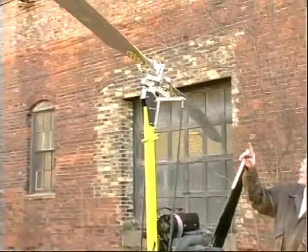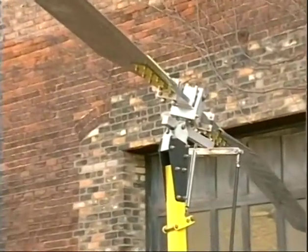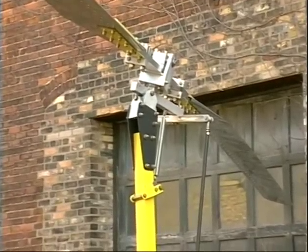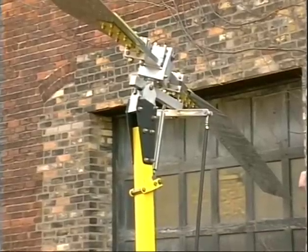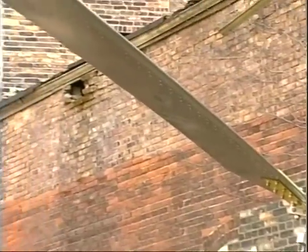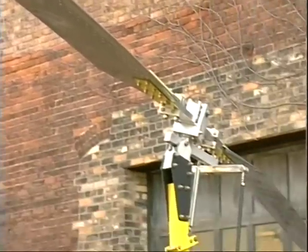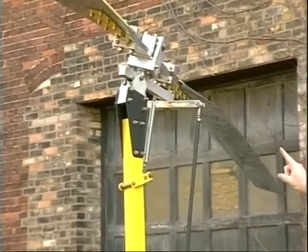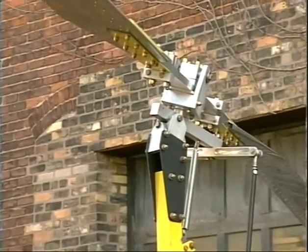Now, another element in making the gyro, more specifically the Honeybee gyro, fly the way it does, is the rotor system. This is a 24-foot Rotor Hawk control system. We use a synchronized system that Neil puts out for us at Rotor Hawk that uses his blades, which are a three-piece aluminum blade. We use an aluminum extruded leading edge with stamped and formed skins that are both bonded and riveted to that leading edge. And it is then coupled with a 2-foot hub bar, and then it goes into Neil's control head.